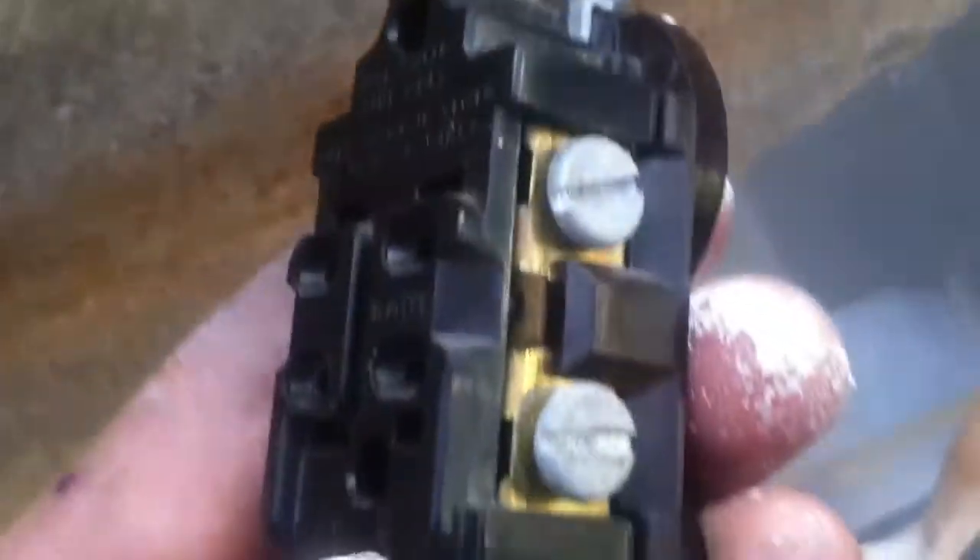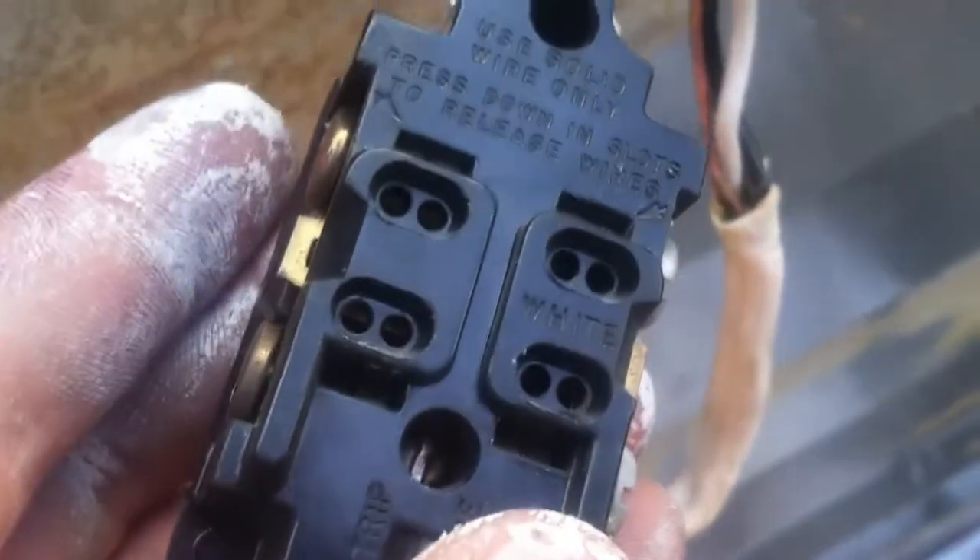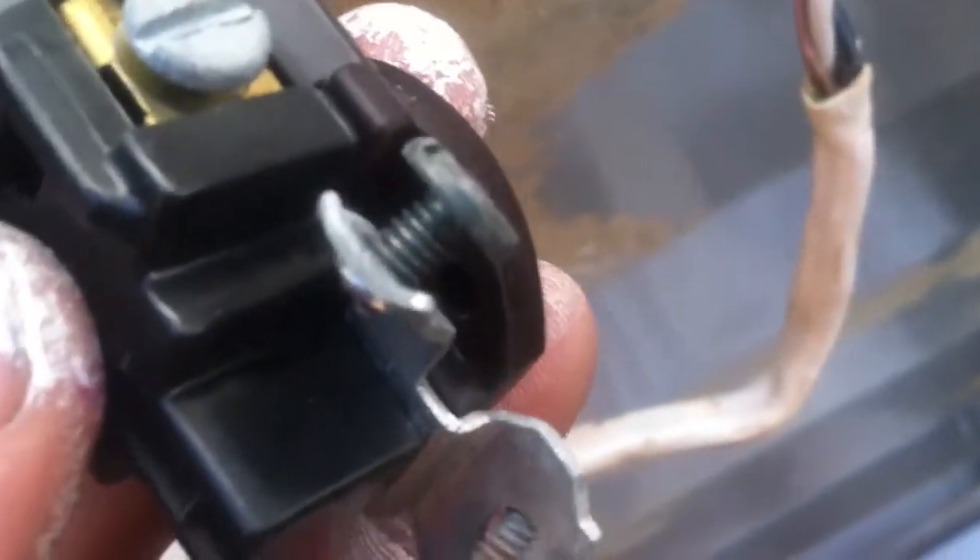There's the whites — you can see it says right there 'white.' Put the white wire in there, clamp it down. And over here is black, same with the black wire, clamp it down. And then the one that looks like a hook is the ground — do it into there. For anybody that didn't know how to do that. We had to take this one apart because the plastic cap was cracked, so I'm going to replace it.